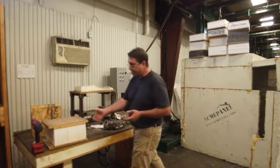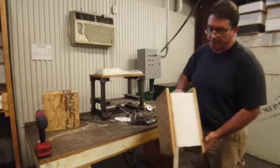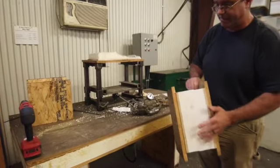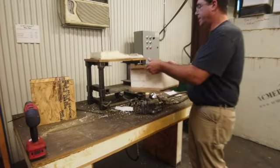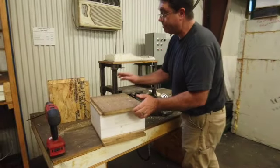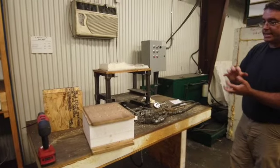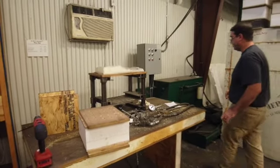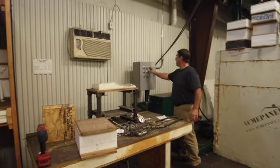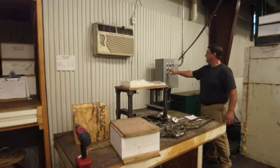So what I did is fasten these two plates onto this one panel. This is just a 12 by 12 block, 6.5 inch panel, and we're going to set it up in this machine. It's going to pull it apart, and we'll check the pressure that it takes to actually pull the skins apart from each other. And it's conveniently per square foot, right? Yes, it's per square foot, so it makes it really easy. Yep.